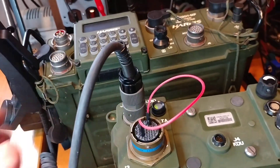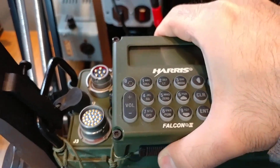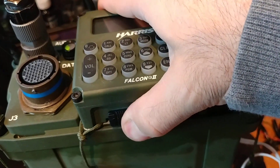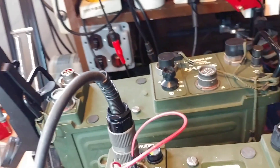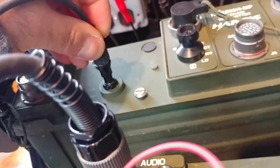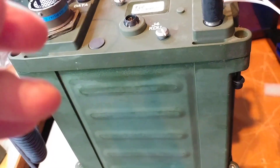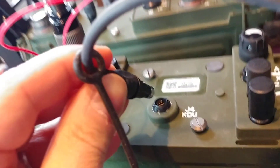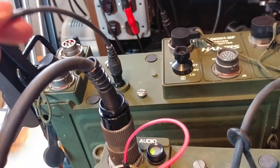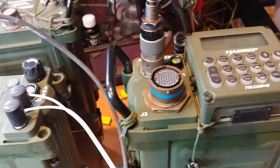So how do you control a radio over this? What we do is slide this over and remove the KDU from the radio, then place the KDU right here and lock it in place. Then we use one of these KDU control cables — becoming quite common on eBay these days. These cables are normally used for remoting the KDU on your body; you wear the radio on your back and use the KDU on your wrist while mobile. In this case, we connect it here, so now we've connected where the KDU comes out of the radio and put it into the remote unit. This system will convey all of the KDU data.